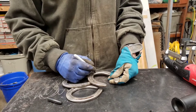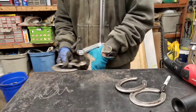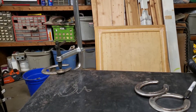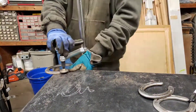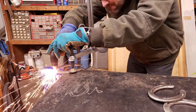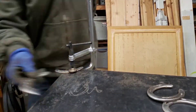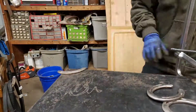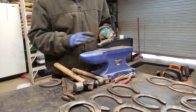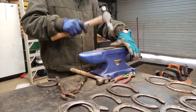Now that they're pounded into a good shape that I can work with, I'm going to kind of lay it out and start cutting the pieces. The letter B actually takes three horseshoes to make. So I'm going to use my plasma cutter and cut off part of a horseshoe, then knock off the slag that results after using the plasma cutter, and pound that piece into shape.